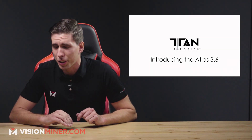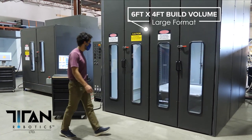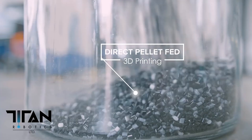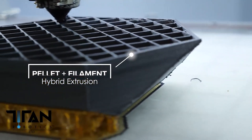Next, Titan Robotics released their Atlas 3.6, their largest pellet extrusion printer to date. At 50 by 50 by 72 inches — or 1270 by 1270 by 1828 millimeters — it's capable of printing parts up to six feet tall. It has an actively heated chamber up to 80°C for high-temp composites like CF Ultim. It also offers several extrusion configurations: single pellet, dual pellet, hybrid dual pellet plus filament, and hybrid single pellet plus filament — all based on closed-loop industrial CNC control systems. I've seen these machines in person; it's absolutely a beast of a machine. They're built in Colorado — really cool people, be sure to check them out.